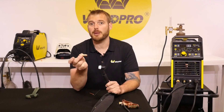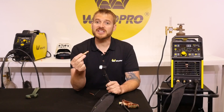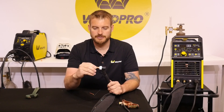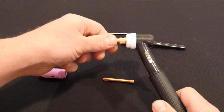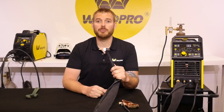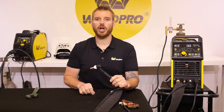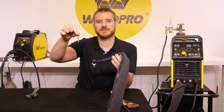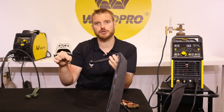Last but not least, we're going to set up the TIG torch. With your TIG torch in your non-dominant hand, locate your collet body — this is the thicker of the two copper pieces. The collet body will thread in on the white heat shield end of the torch. There are knurlings on the collet body to help you tighten it by hand — don't put a wrench on here, as you could ruin the threads inside the torch. Once your collet body is installed, go ahead and install the collet from the back side. The collet is the thinner, smaller copper piece.